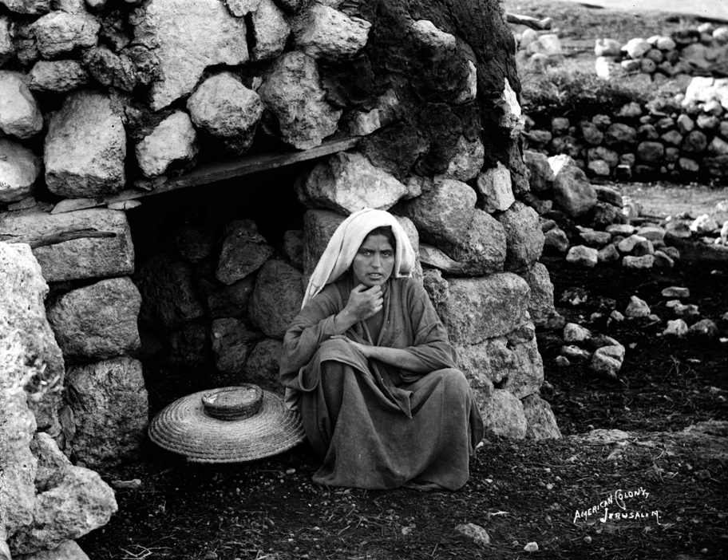The shell is made of yellow pottery clay soil. The best is from Arrub or Al-Arrub. The soil is wetted and made into a thick clay mixed with chopped wheat stem hay. The clay is hand-formed to make the dome-shaped shell. It is about 30 to 40 inches in diameter at its base, about 15 to 20 inches high, with an open top approximately 15 inches in diameter. The shell wall is about 1 to 2 inches thick. The shell is sun-baked for weeks.